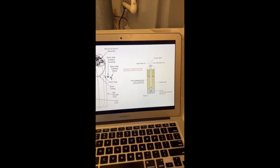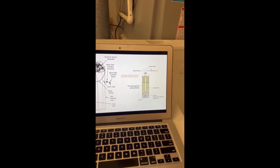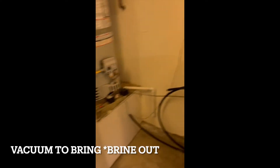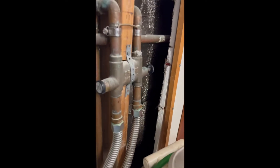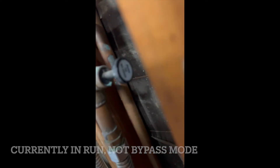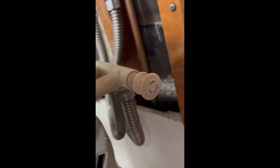So just to recap what the Venturi is actually doing: it's bringing water in as an opening valve and then also doing that suction or vacuum to bring that brine back out. Also, right before I get into the fix, I just want to make sure you guys are bypassing your system before opening anything up. You'll either have a bypass valve here or there, and you just push it in for service, or push it in for bypass. You can do it if you have one for your house or one on your actual water softener.